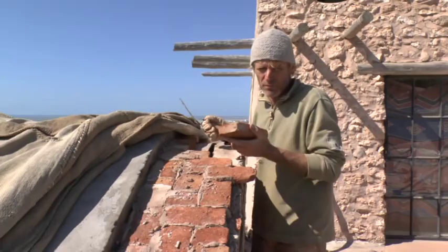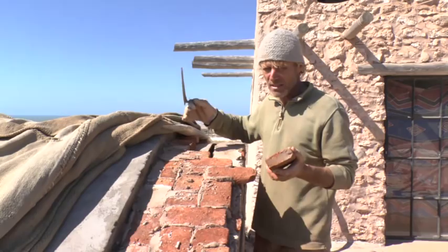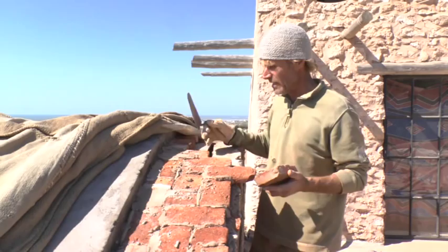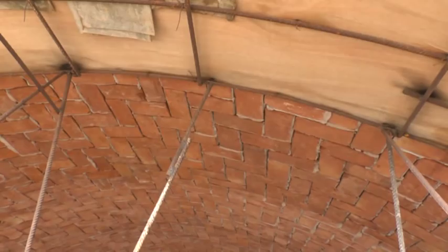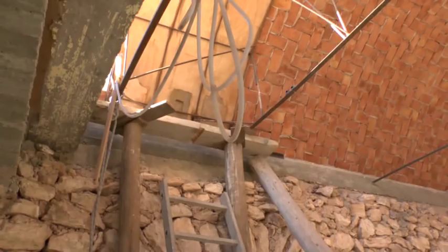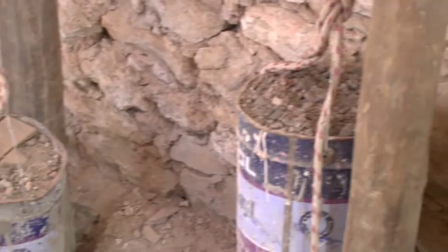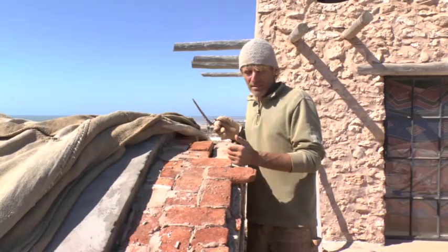The whole thing now slopes because we kept dropping the form, so there was less distance over the arch each time. To get the same number of bricks to fit required more and more cutting every meter to keep the pattern. The form, which was designed to be raised and lowered on four bolts per side and slide on oiled steel runners, had to be abandoned after the first meter — now it's supported on four poles and weighted down with buckets of rubble, gone from high-tech to very low-tech. In the middle the bricks are half the size, but we've retained the pattern and no one will notice. I know how to do an arch now though — I didn't before.